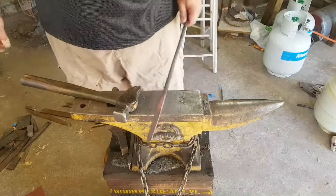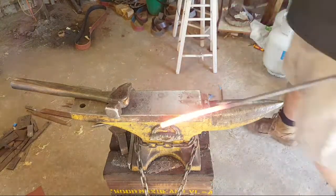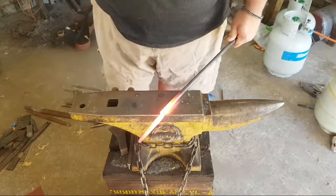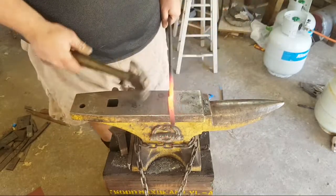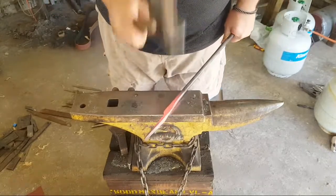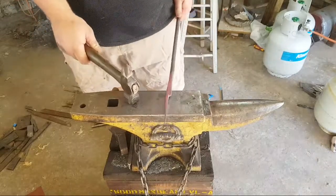Set that boss. Set it right there. For a right-handed person, once you come off the shoulder, you want to turn it left, 45 degrees out. That's a terrible hit. Now the boss is quite narrow on these because the material is so narrow. So you want to leave it relatively thick at that junction. It's about as far as I take it. Not very far at all.